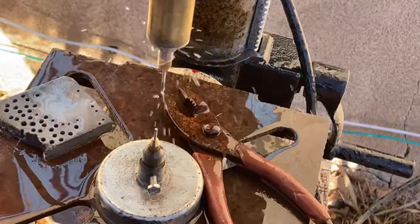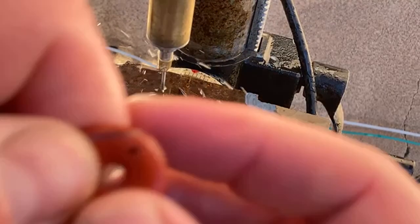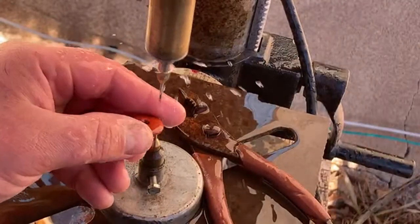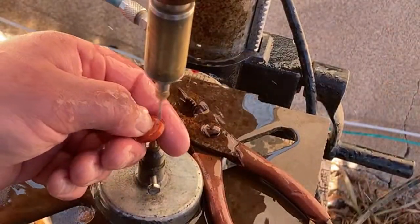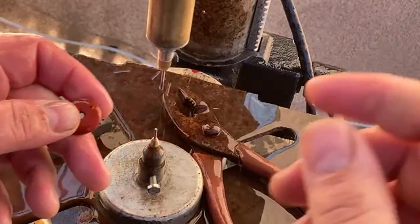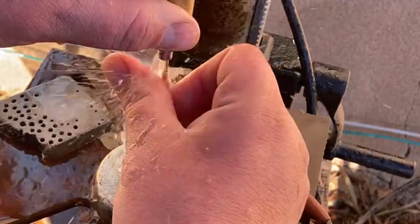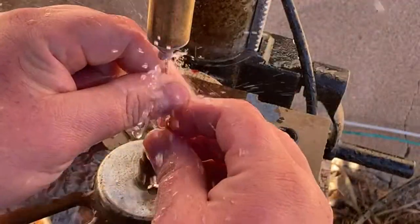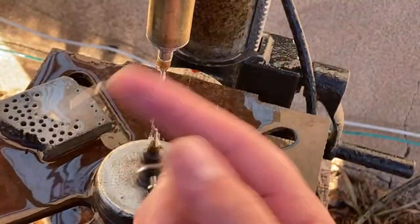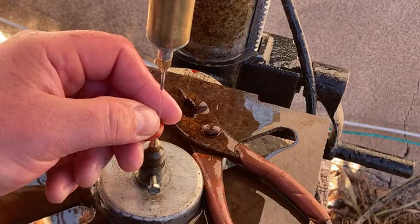Okay, this is a tricky one, so I'm going to try to use this piece of steel right there. Ah, got it. There we go. If I ever got another commission, like drilling those 5,000 crystals. All right, it's caked up, so we're going to take it apart. Just being safe. Sometimes I get lazy with the 2.5 millimeter, and I'll take an injector pin from an old burr and stick it in there, and it cleans itself out so I don't have to do what I just did here. But it's really not too much time to do.